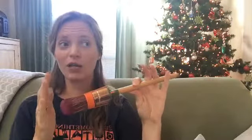This brush, if you're working with a chalk type paint, will give you a very nice smooth finish. Now, will you still see some brush strokes? Yes, you will. I used this the other day. I still see some brush strokes, but it's smooth. They're not errors, okay? We want to separate brush strokes from errors, but it's smooth and it's solid and consistent.